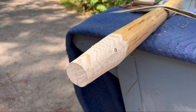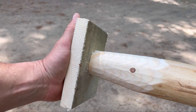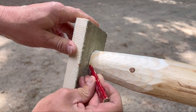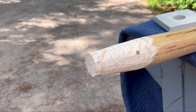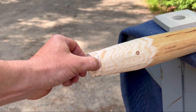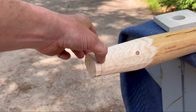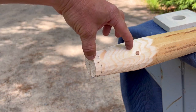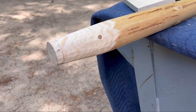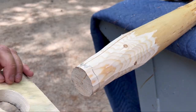Now with my template I just put it on there — and she starts to go on, see that? Here's the back side of the log. I put my template on and take a pencil to trace around the whole template, then pop off the template. You can see my mark. Now with the draw knife I don't peel here anymore — I peel back of this line going up the log. I'm making these three and a half inches, so I'll make another three-and-a-half-inch mark back here so I know where to stop as I go up. Then we start peeling again — keep checking with your template.